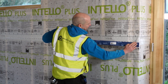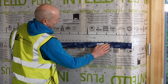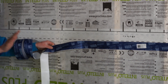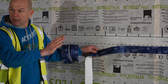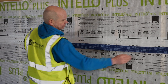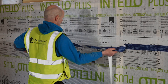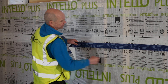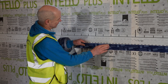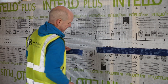Instead, you really want to follow the line of membrane first. If you had creases, or if there was a bit of slack, you just follow the membrane first. You're peeling it off, going along, following the dotted line, and so on. The aim isn't for the tape to be as tight as it can be — it's for the tape to perfectly mimic the membrane. A hundred percent. And then just cut it there.